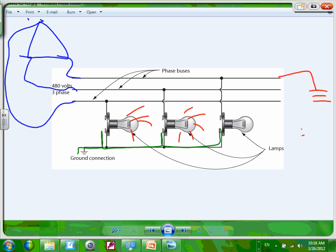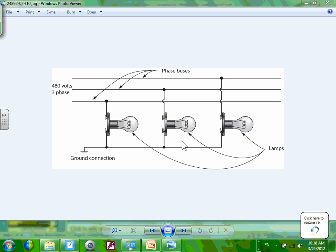How do I know that there's a ground fault in a delta? It's an ungrounded system. You put an indication. There's also electronic ground fault protection, guys, and so forth that you can put on it. But this is the visual indication that you have a ground fault.